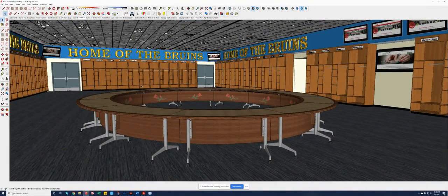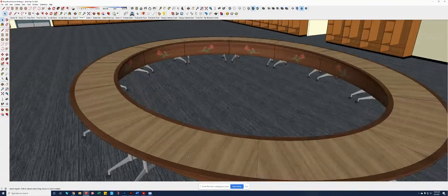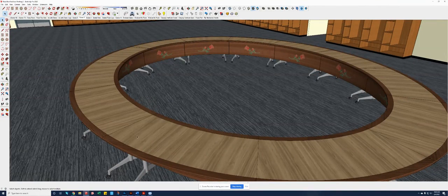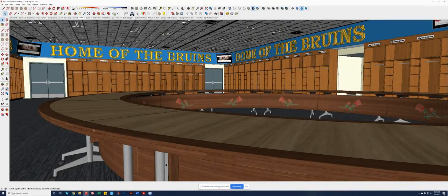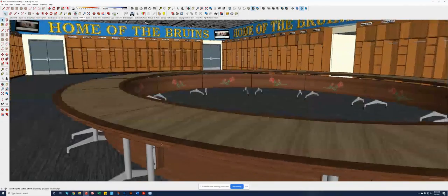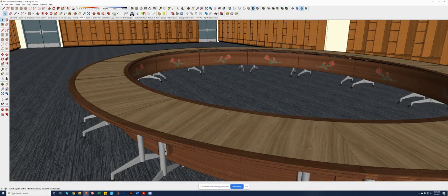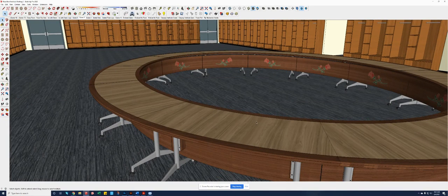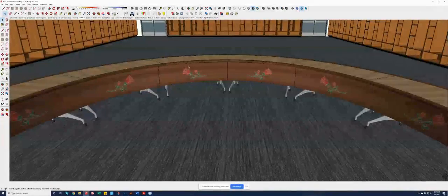The table that you're looking at now is made up of several different materials. What I'm showing here is a laminate surface, which is the field of the table — this laminate is a highly durable material. The edge of the table would have solid dimensional lumber glued onto each edge, so the front and back edge will be solid sapele, which is in the mahogany family, and the field of the table would be laminate. We'll be pricing that out as a wood veneer as well so you can see the difference. For this presentation, I will be showing the laminate option with the solid wood edge.